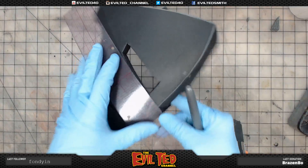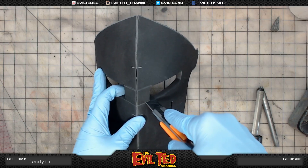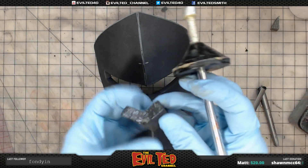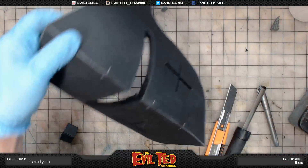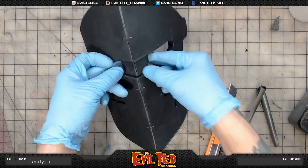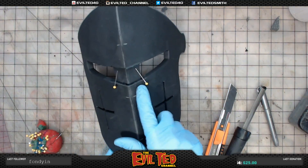Come right inside like so. Now the whole purpose is so we can recess this piece back. I'm going to apply some glue to the piece here and the piece here, and the same inside as well. You do not want to wait for this to dry — you want to do this while it's still wet so it gives you some time to float the part in there. I'm going to take some straight pins and pin it in position while the glue solvent evaporates, to hold it in place so it doesn't move on me.